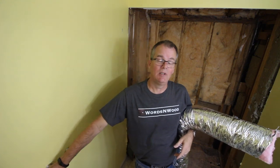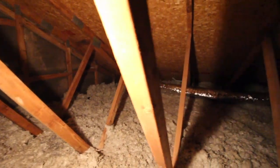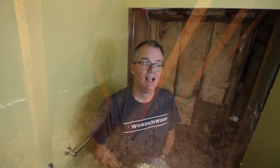I checked other fans — maybe I don't need 110 cubic feet a minute. I looked at 90 and 70 CFM fans from the same manufacturer and they both require a four-inch exhaust hose as well. So it's just another renovation headache, and off to the store to buy some four-inch insulated duct. That meant even more crawling around in the attic to find the outlet, disconnect it at both ends, connect up the new hose, and feed it through. While I was doing that I ripped out the old fan and now I've got the new one installed. I'm not looking forward to doing the same thing in my own bathroom, since I'm not renovating it, but I did want to replace that fan at the same time.